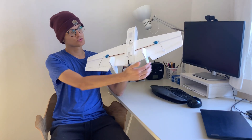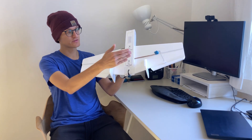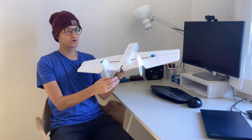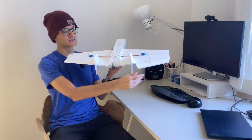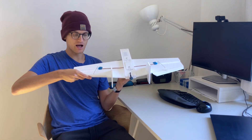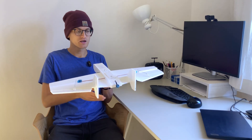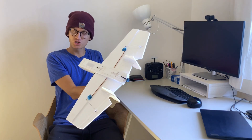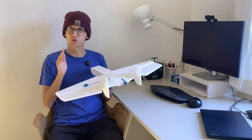The plane is controlled with two control surfaces called elevons. To control the pitch, the elevons are deflected in the same direction — if both are deflected up, the plane pitches up; if both are deflected down, the plane pitches down. To control the roll axis, the elevons are deflected in opposite directions, so one is deflected up and the other down, and the plane rolls. It's also possible to combine these two movements — for example, if only one elevon is deflected up, the plane rolls and pitches at the same time. I don't have a way to directly control the yaw of the plane because there is no rudder. However, even in planes which do have a rudder, you make turns by rolling and pitching into the turn. So as long as we have the vertical fins to stabilize the yaw, we can get away with just two control surfaces, which helps to reduce weight.